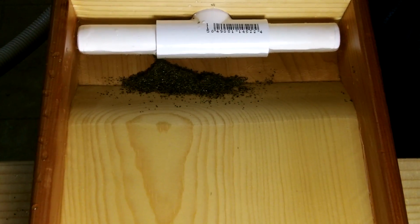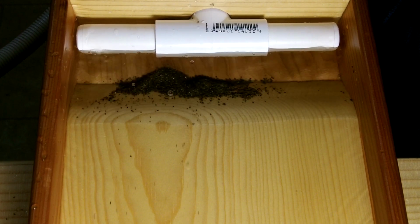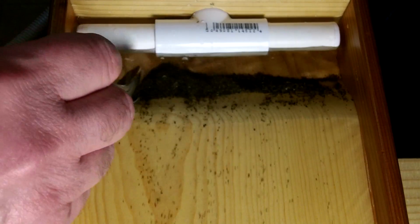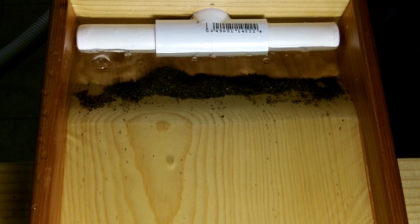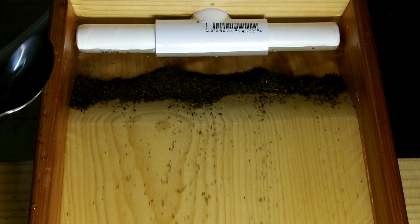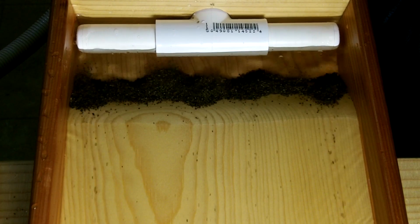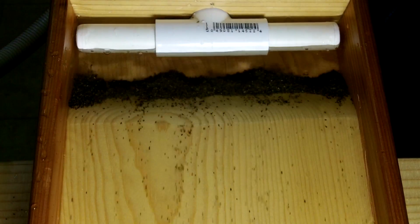So I decided to make another run, and I screened some material down to about 12 mesh and decided to run it. I removed as much of the black sand as I could so that we didn't have to deal with it. So what's happening is if you screen all the material to the same size, the gold will drop out and the lighter material will wash off. And so what you'll end up with in the bottom of your deep well is just your clean gold.